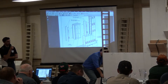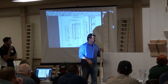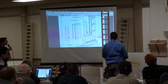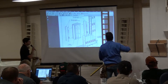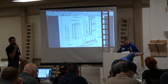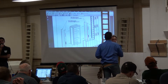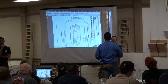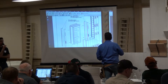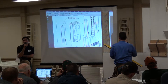Go ahead and put in a full height stud. Then we have one of the components we didn't talk about yet — what you can see in the drawing is what we call a shut-off stud. When we figure out materials for a project, alongside all your openings, windows, and doors, we're going to figure the shut-off stud.